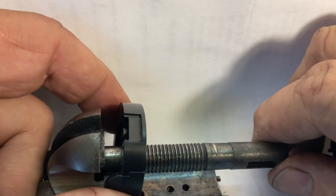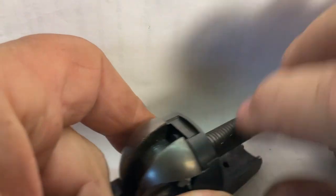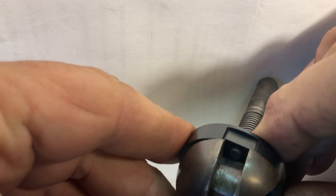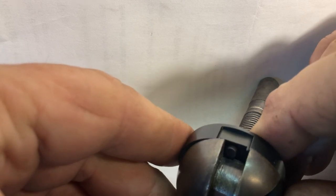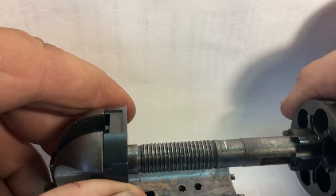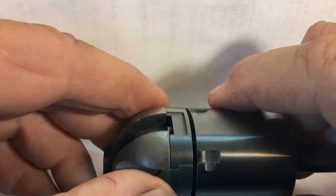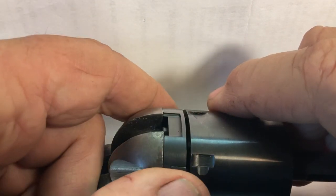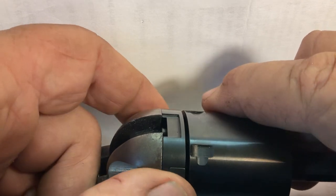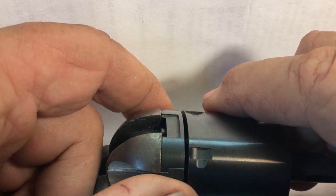Let's see if I can emulate it like this. Typically, that's not a problem unless when it moves, it moves enough that the hammer can hit that shoulder there in that projection. And if it does that, then that needs to be corrected. So in a basic installation, if your ring wobbles a little bit, as long as it doesn't cause a problem, you're good to go. If it does cause a problem — if the hammer strikes it — then that's addressed in the installation.